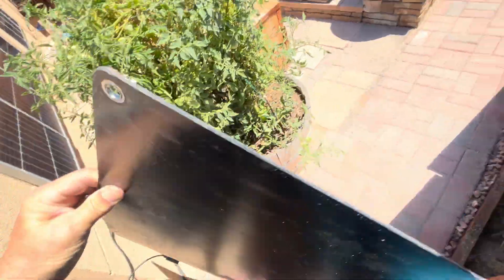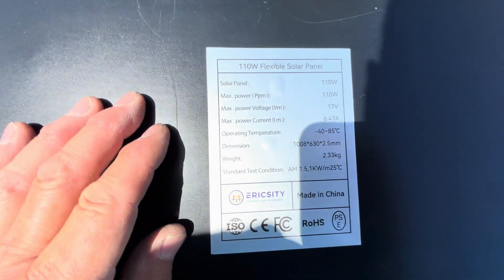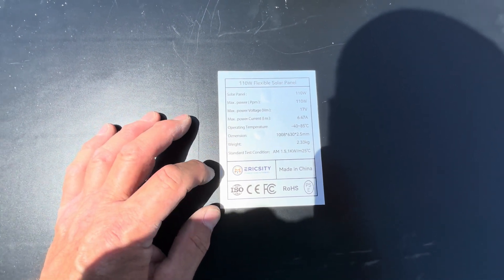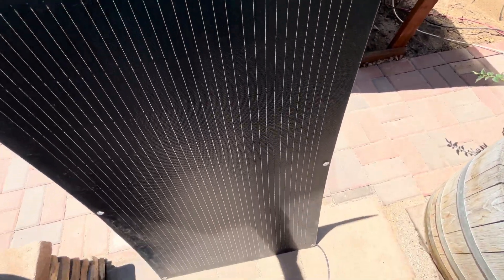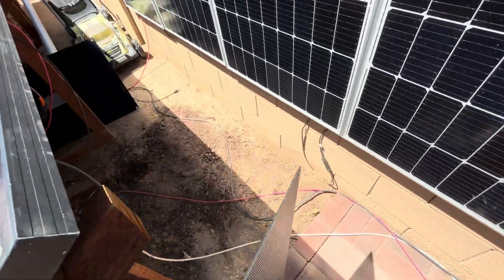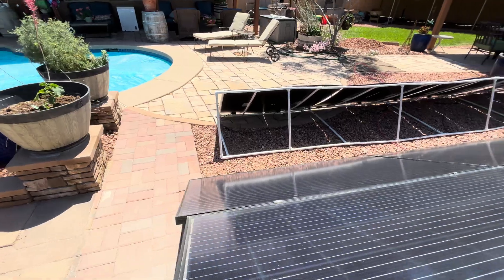Let me grab one of these and hold it up so you can see. They're 110 watts, 17 volts, 6.47 amps, and they're right around 5.1 pounds — not heavy at all. The junction boxes are in the back for the positive and negative, which is a little different, and you have six grommets on these things. They're giving me 80–85% output, and I've got them built at like a 35-degree angle.